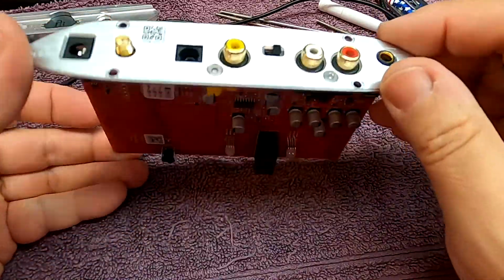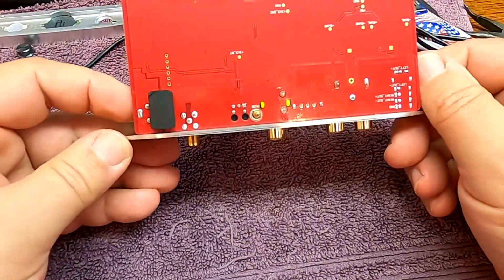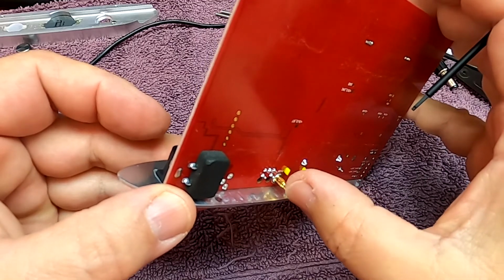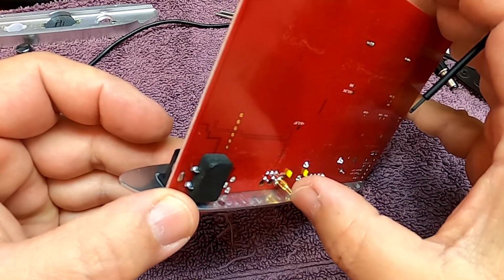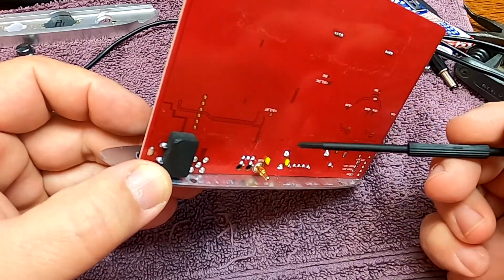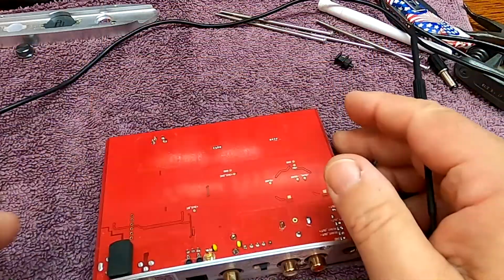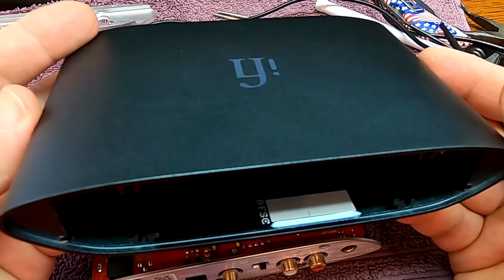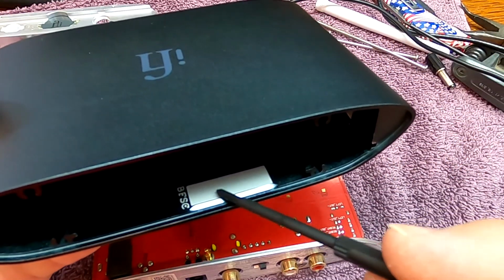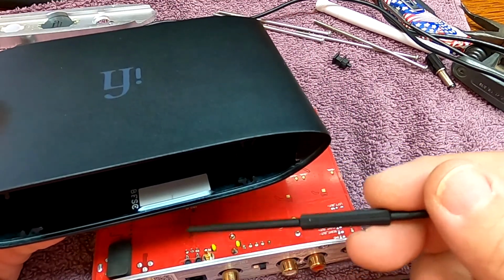Okay, to the board. Well, that's a pretty clean layout. We have a grounding pin. You don't see this too often. This is kind of something we see in radio, but this little pin is spring loaded, and what this does is this ties the board ground into the device's chassis ground. So the whole thing is grounded. And depending on how that's wired in circuit, that'll be for noise isolation. And there's the little contact strip for that. So this will make contact with this.